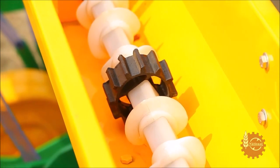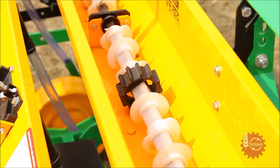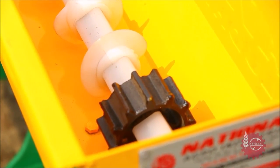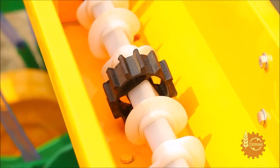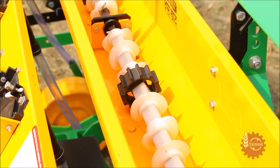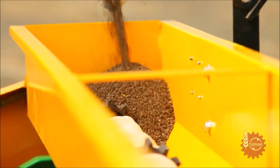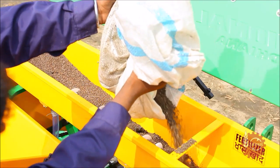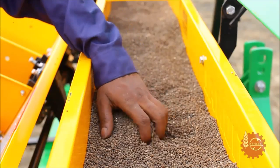National Maize Planter's fertilizer hopper has a shaft with an array of small agitators and worms. These worms ensure the proper movement of fertilizer in the hopper and agitators break the fertilizer clods, if any, to ensure continuous supply of fertilizer. Fertilizer hopper should be filled with fertilizer. Care should be taken to avoid any foreign particles and clods of fertilizer which can obstruct the system.